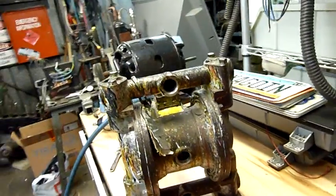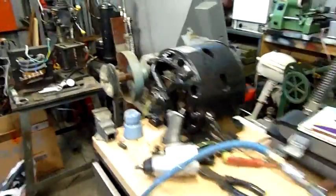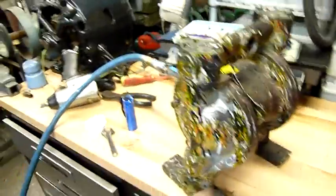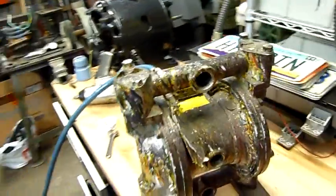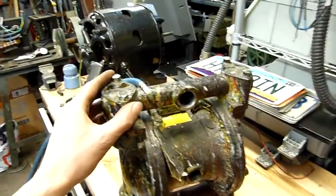They're really simple. You probably see different examples in the field if you work in various industries, particularly where you're pumping combustible products where you don't want any kind of flame or fire nearby — like sparks from a motor or even an induction motor where there's a risk of a field winding arcing over. You've got to have full stainless steel explosion-proof motors. All of the conduits have to be armoured and explosion-proof — gasketed. All the enclosures need special flame-proof, explosion-proof enclosures. Yeah, petrochemicals, paints, that sort of stuff. That's why you see a lot of this sort of stuff air-operated rather than electric.